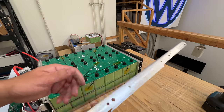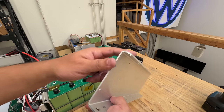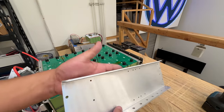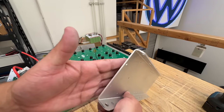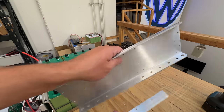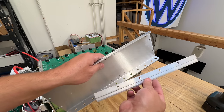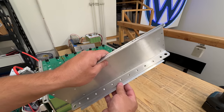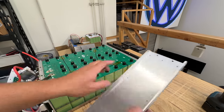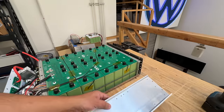Here's the first revision on this plate right here, which is the compression plate that goes on both sides. We fold it up on the top and on the bottom because we're flexing a little bit. Adding another bend on the top makes it a lot more rigid. Even though we're using aluminum and it's light — we wanna keep this light because the batteries already weigh a lot. We also added all these holes here that match the French cleat that we decided to use. Now when you put it in there, the same bolts that attach this to the case will also hold the French cleat, so that's less hardware and easier to install.